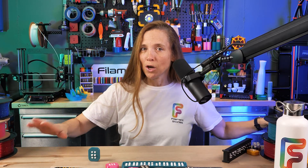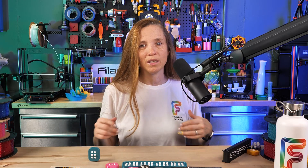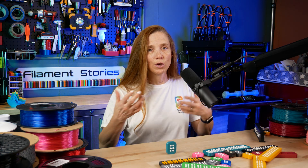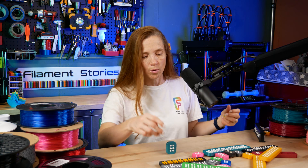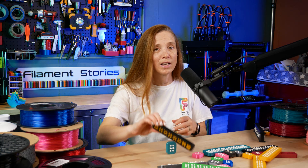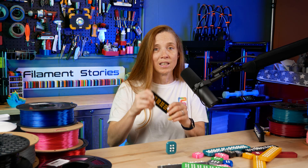If you're in the U.S. and hopefully around the world, I can give you some suggestions — there are companies that very clearly state their shore hardness. If you're looking online and find a filament that says it's flexible but has no shore hardness number, it's probably 95A. I would not buy it unless you're sure it's 92A, because you might go through all the printing, put the buttons in, and find it's really hard to click. We had some that were so hard my daughter and I got through about two buttons and were done. That's the difference between 95A and 92A, which is just really easy to push.